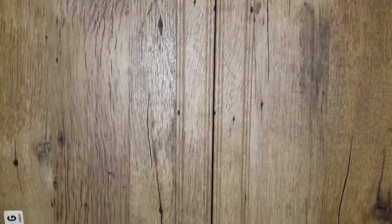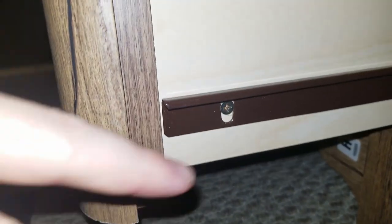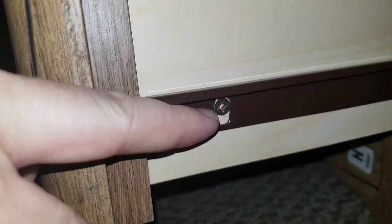That's how you adjust the hinges. And then the drawer is adjusted at the front of the slide — it's a slotted hole with a screw. You just adjust it so it's not scraping or hitting anywhere.